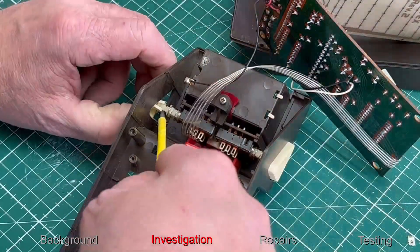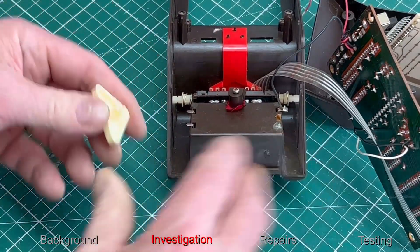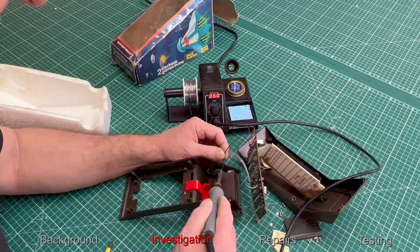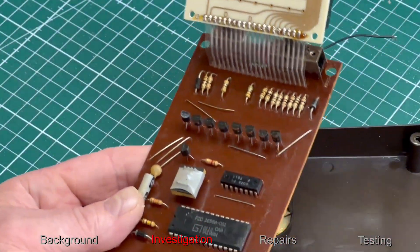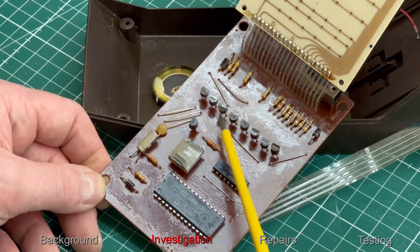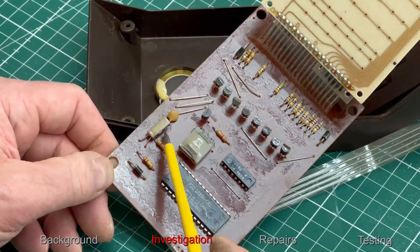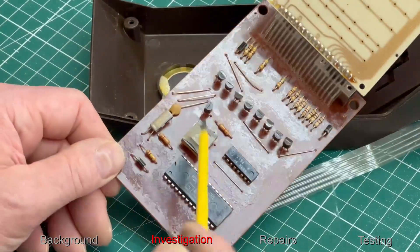Let's release the multi-switch combination board, because we've got some cleaning to do, some function checks, and we're going to have to rebuild the battery compartment. So we need to remove all the devices from that side of the casing. This is the first view of the main circuit board — we've got some resistors, some diodes, some transistors, something that looks like a choke, a little inductor, and an electrolytic capacitor. These are now around 50 years old and the electrolyte in them tends to dry out, so we'll definitely be changing this component.